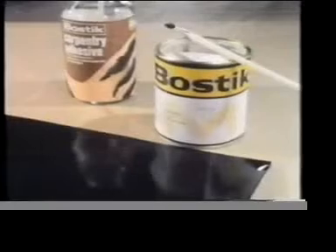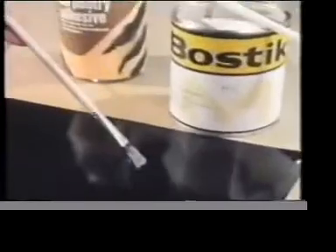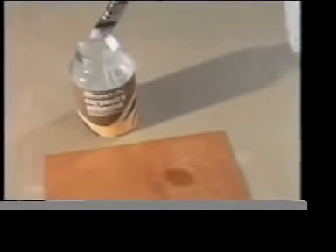To make a successful bond, several factors must be considered. Here are two types of adhesive. Let's try the one on the left. On this plastics material, the adhesive collects into globules. It doesn't stay spread out on the surface — we say it doesn't wet. Let's try the other one. This remains as a brushed out film. It doesn't collect into globules; in other words, it wets the surface of this material. This is one of the factors necessary to produce an effective bond. But what about that first adhesive? It's designed for joining wood, so it should wet a wooden surface. And it does, except in one place. Can you think of a reason for this?